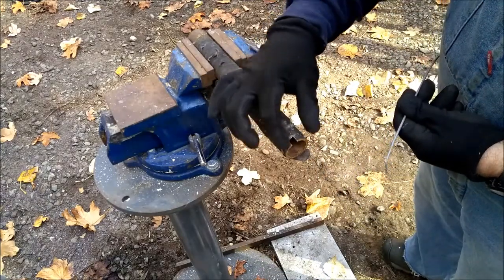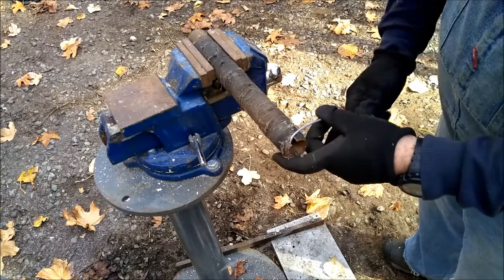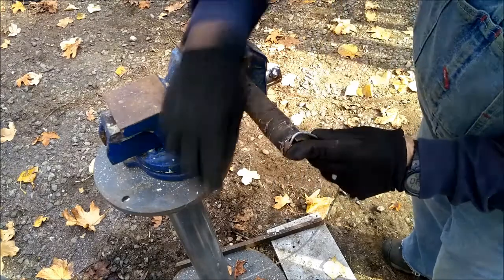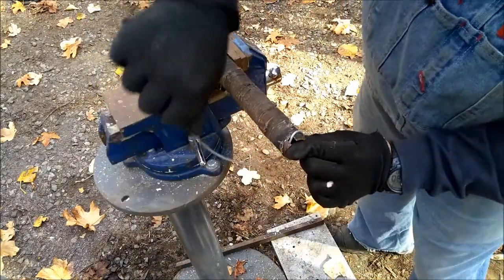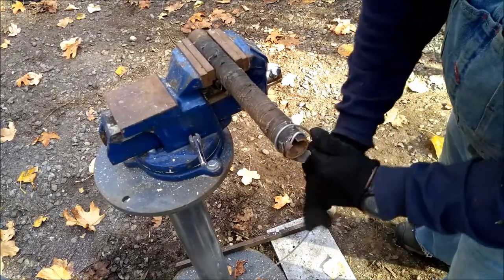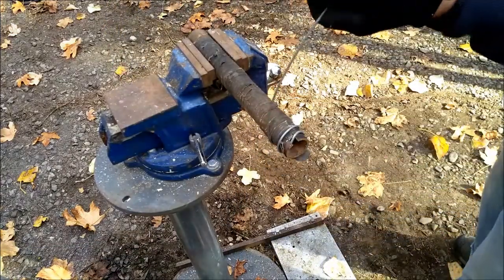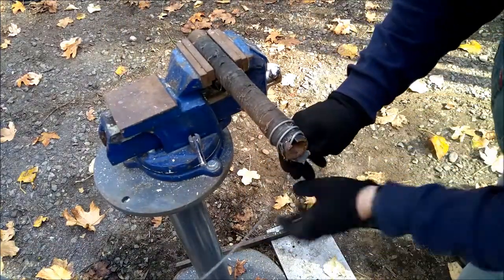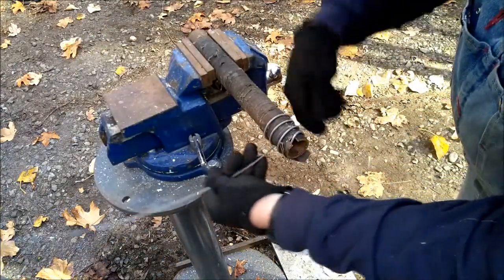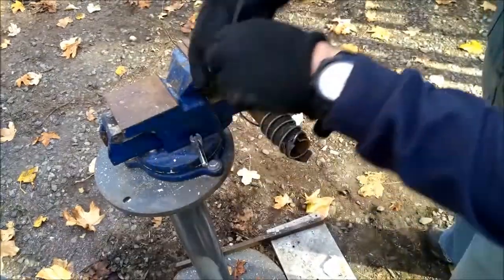So I've got this piece of pipe with a notch cut out of it. I really should put a hole in it, and it kind of holds wire while you bend it around something. The springs I have are smaller diameter, so I do want one that's a little larger diameter, so this pipe should do that pretty good. I'm not sure how many wraps I want — maybe a little more than you think you need, because you can always cut them off.